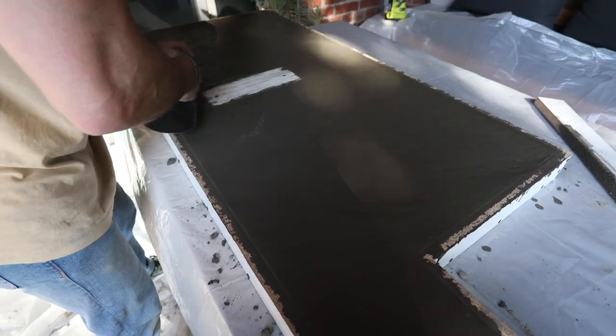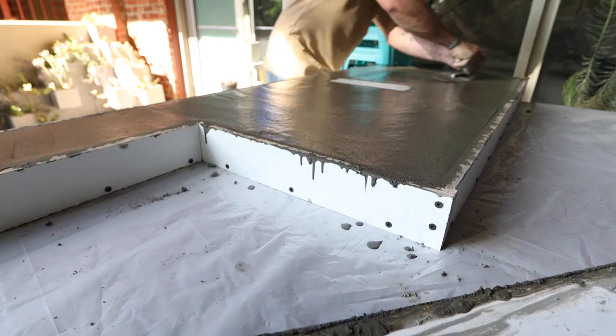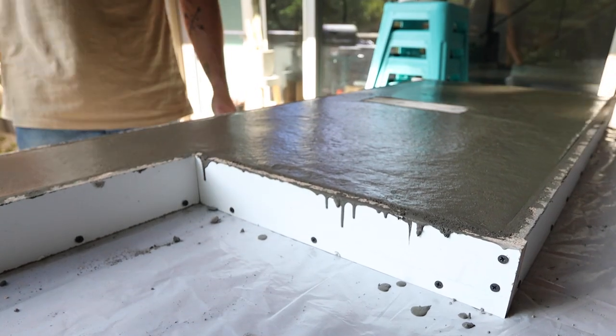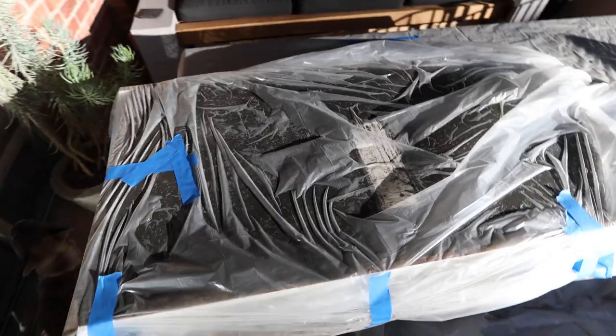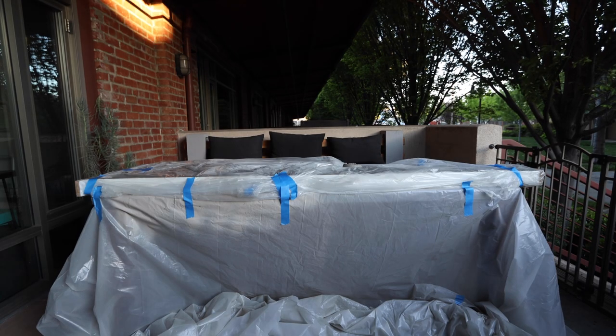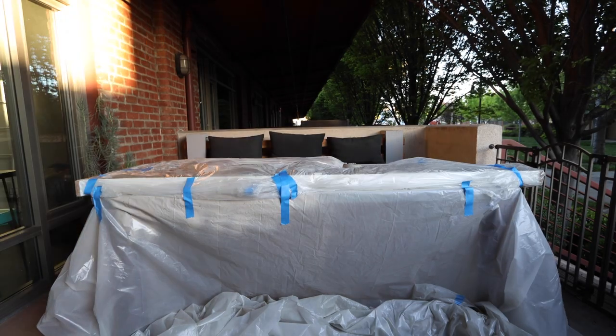Now for the final troweling. Don't forget this exposed surface will be the bottom so this doesn't have to be perfect. I have never troweled concrete before but it really wasn't too hard — just take your time and smooth everything out. In order to let the concrete dry it is very important to cover the mold with plastic. Concrete needs water and moisture to cure properly so the plastic will prevent too much moisture from escaping too quickly. Every 24 hours or so I spray down the concrete with water to aid the curing process. For this large of a project it's best to wait at least four days, but I waited about a week to be overly cautious.